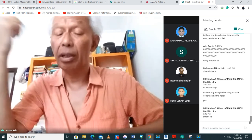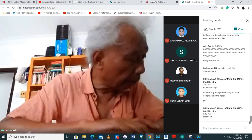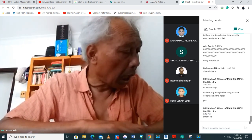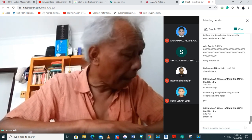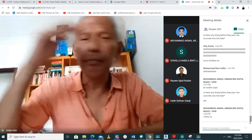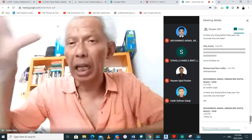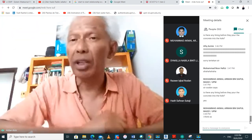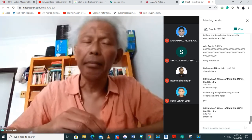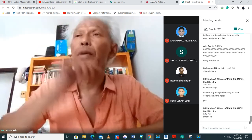Then this is reliable for settlement estimate. So if I look at figure 8.21 on page 342, I see in A, the maintained load test. So I put the load on the concrete block. I let it be. I allow for a certain period of time. And then I come back after that time and I load it again, and so I always have this constant load for some period of time.